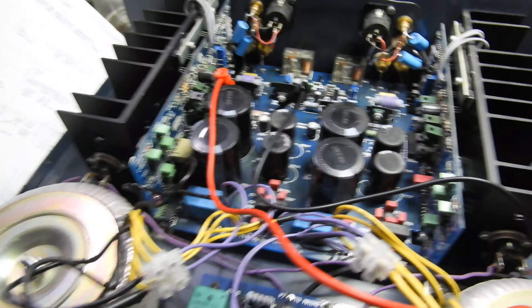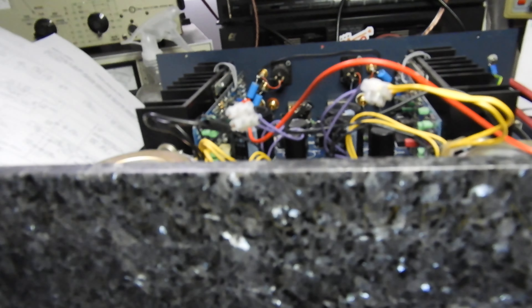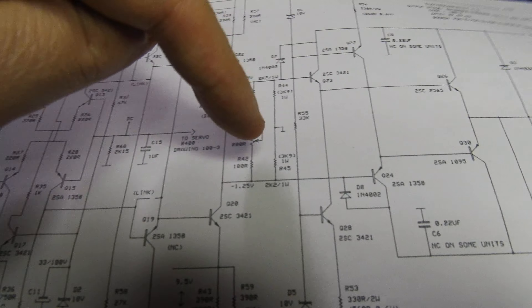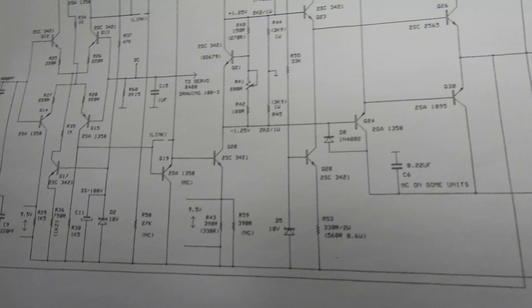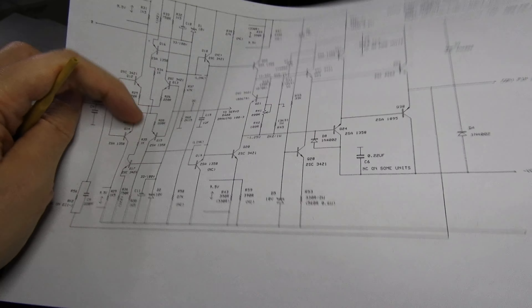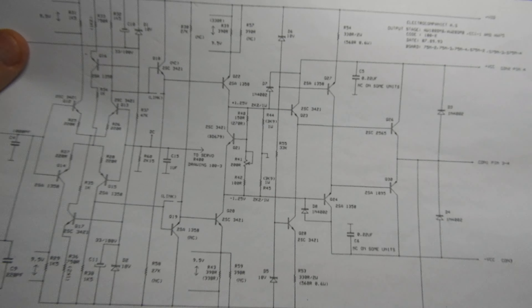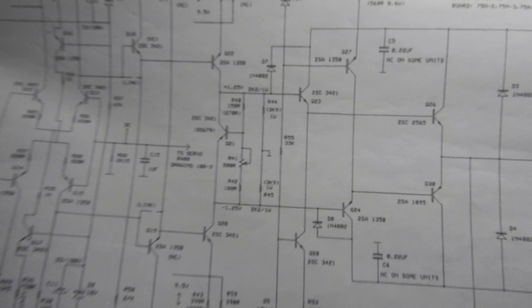It's sad — this is the second power amp I've bought that has been worked on and not done properly. Really, that bias adjustment — R41 on the diagram — sends a bias into the pair of differential drivers going into the power stage. The DC adjustment works fine, so the problem is from there on. If anybody has experience with this, please put something in the comments about what's likely causing R41 to have no effect.